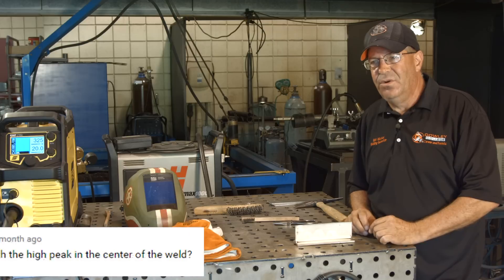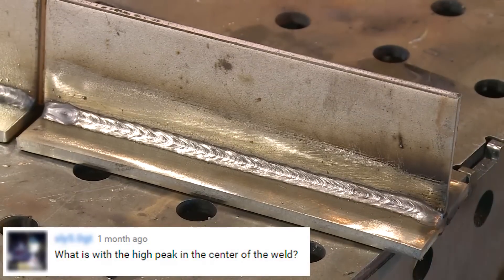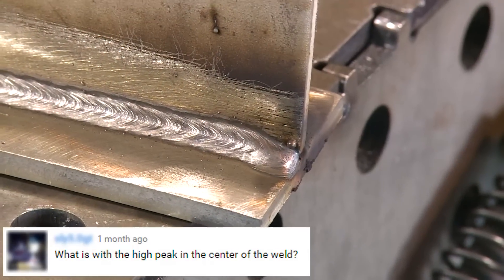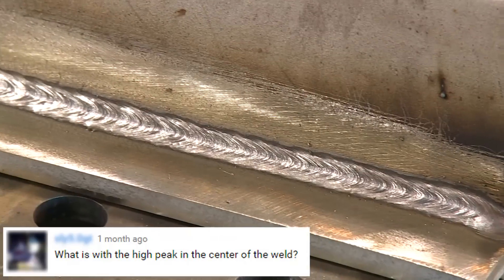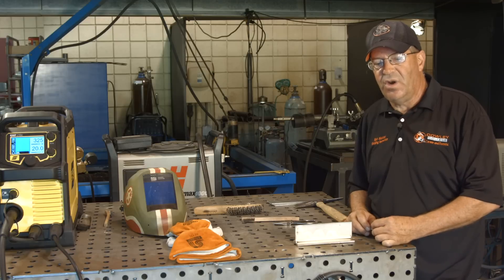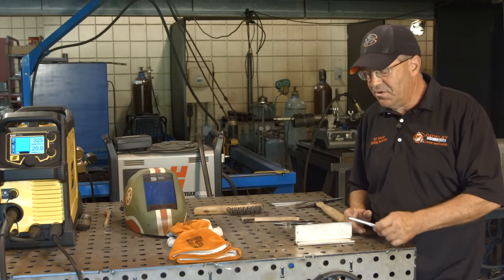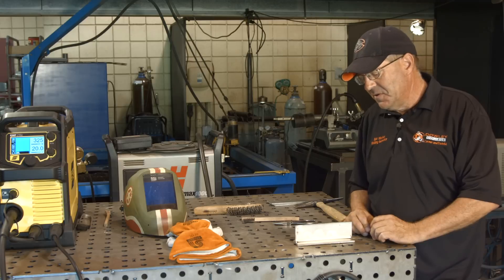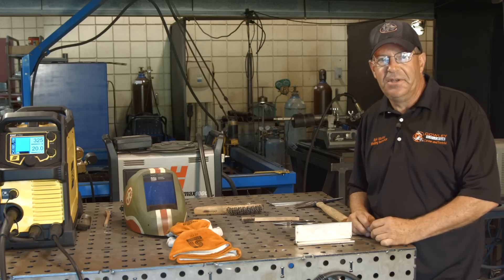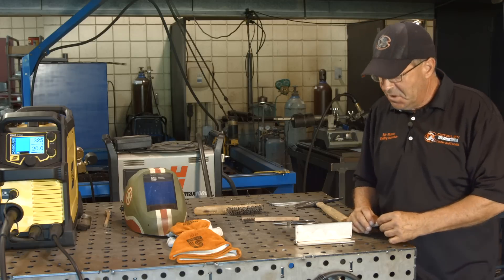One thing I will note — I had a viewer comment that said my weld looks peaked. In all my years of welding stainless, I've kind of always had stainless come out a little bit peaked, and I don't worry about that. When you're welding with TIG, it's easy to get it to lay down nice and flat and you get beautiful colors, but with wire feed, pulse spray will lay down nice. The globular or short arc mode — I've always had a little peak come out and I don't worry about it. I do appreciate the viewer comment; I don't think it was that negative.